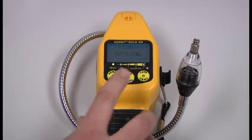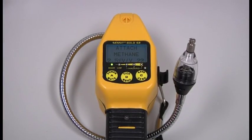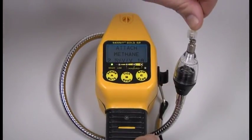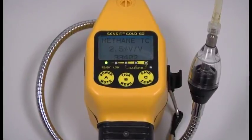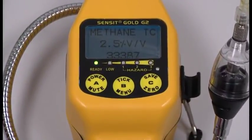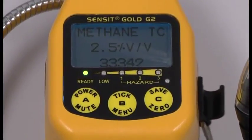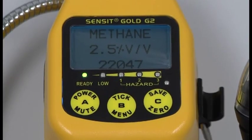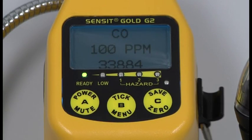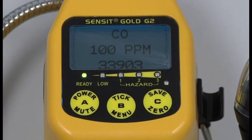Press your B button and it will ask you to attach 2.5% by volume. You have 30 seconds to do so. Turn the regulator on and attach the hose to the inlet. Once the instrument detects that the gas is applied, it will start the calibration. Note the numbers on the bottom are not actual gas readings — it is just a raw output of the sensors. 2.5% was okay. Now it is doing 2.5% by volume, 50% LEL. Since we have a mixed bottle, it will automatically change over and detect that there is CO present. We refer to that as a combo gas bottle.